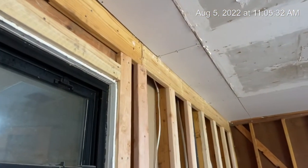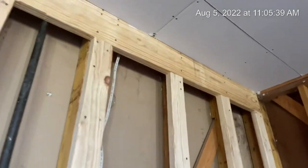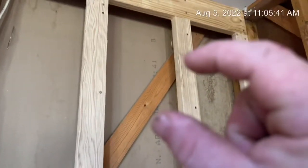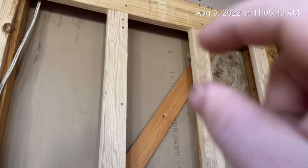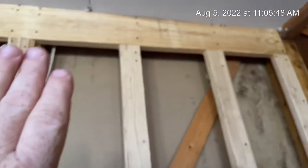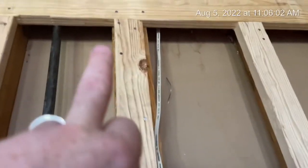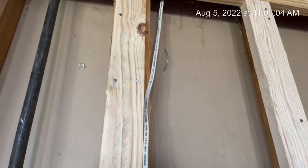Now the fun part is lifting trusses when they're swooped down so much. Over here, as you remember, they were about that far crushed on the 2x4 because of the termite and water damage. So I had to get a 3-ton car jack and this 4x4 post over here, and I took it up to this board and jacked it up until I could get the board under it.